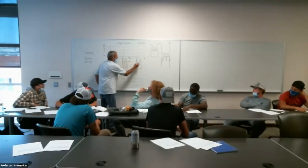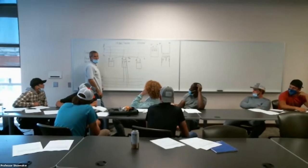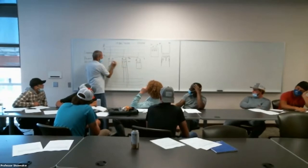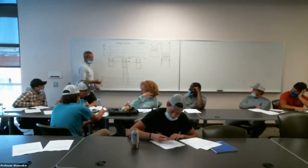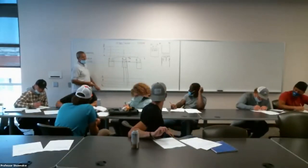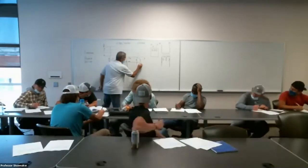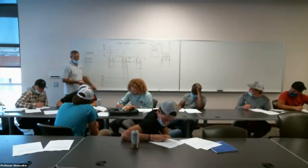What do I need to do to interconnect the transformers? Yeah, tie them. Is that what we're going to say? We're going to tie them together with the tying bus. Don't do any distance changes here. What's closest to closest? There you go. That's perfect. Now, what one secondary wire have I not made contact with yet? Okay. They both go to A.